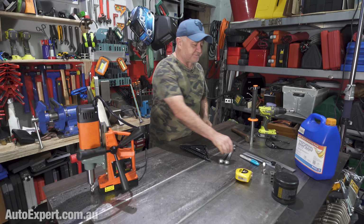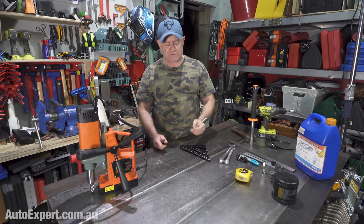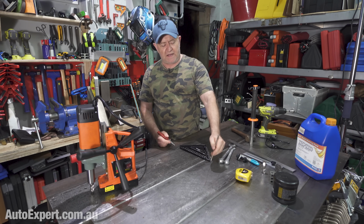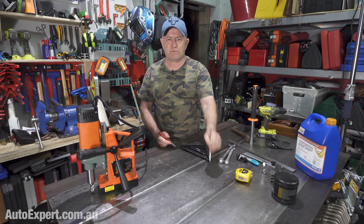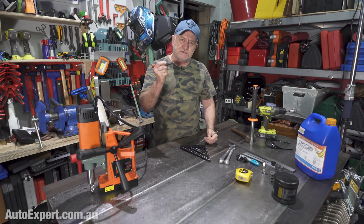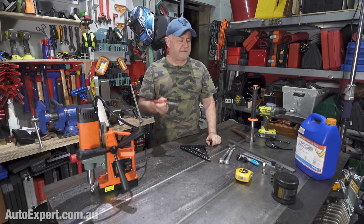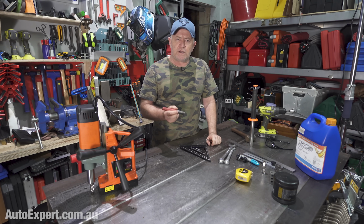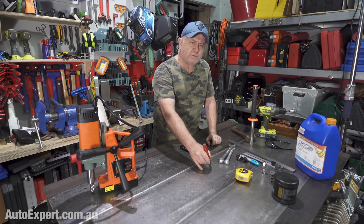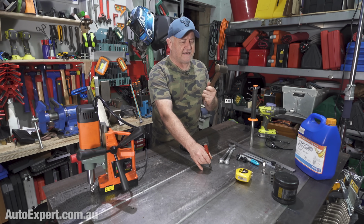The other thing is, when you use a carbide scriber on steel, it carves a little trench. And then you mark X and Y, there's where your hole's going to be. You can feel the intersection of the trench with the sharp point on your center punch, so it doesn't matter if you're blind as a bat. You just feel it and you go, that's where it is. And you do a quick sanity check and then you nudge it with your hammer.